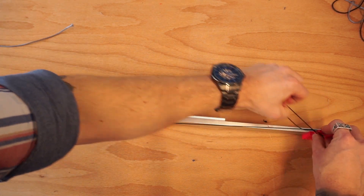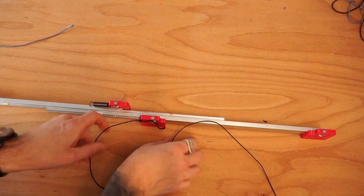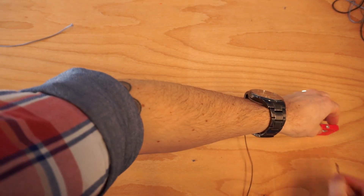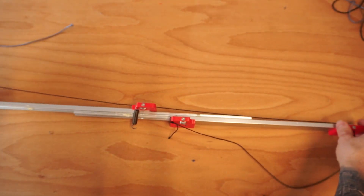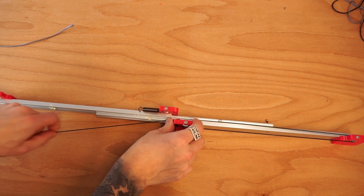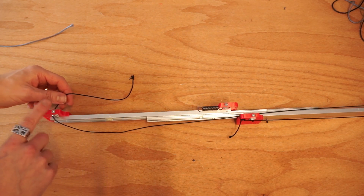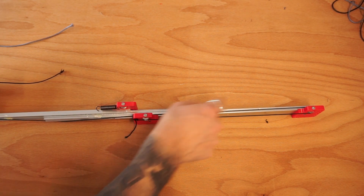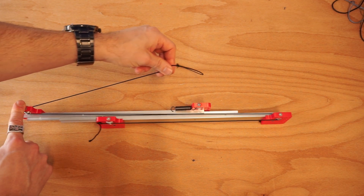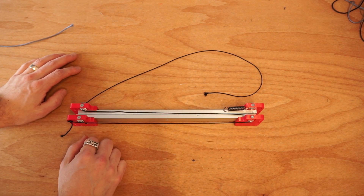For example, if I do a hard tie-off on this side, I can pull hard on the other side and work through the pulleys. Going through the pulley system and through the top pulley, I can pull in the opposite direction to bring it backwards. Continuing through this side and this pulley — now if this were fully extended, pulling on this string pulls on this other string. That string can't get any shorter, so this long string all the way down to the bottom of the system gets pulled shorter and shorter until the whole system retracts.